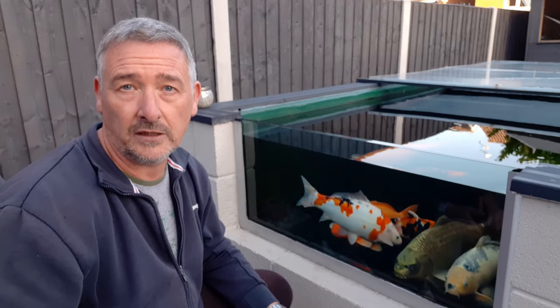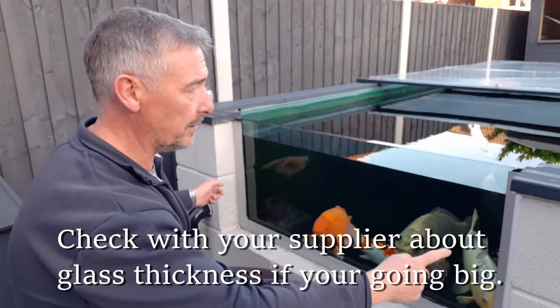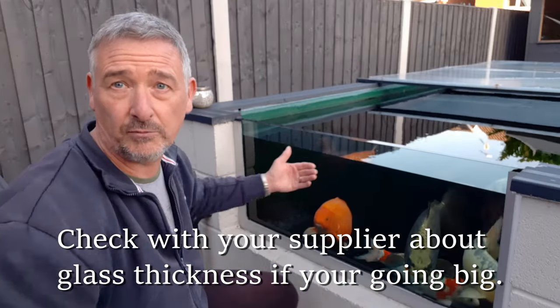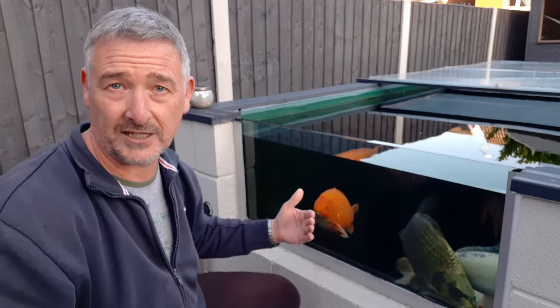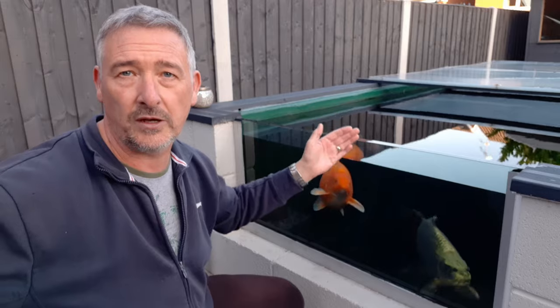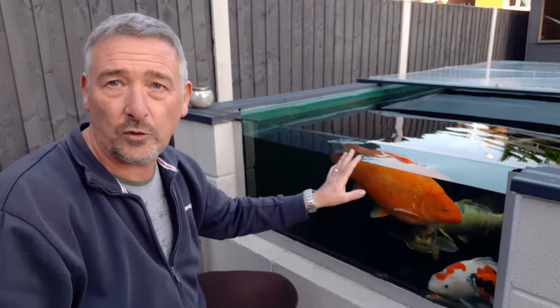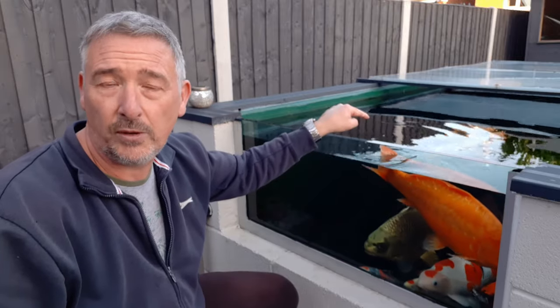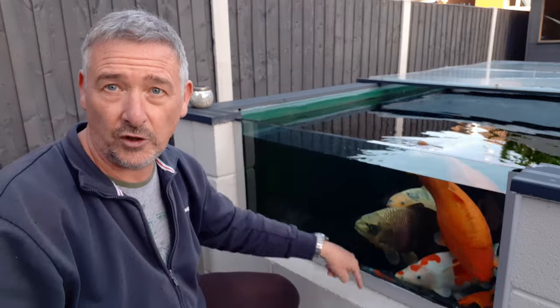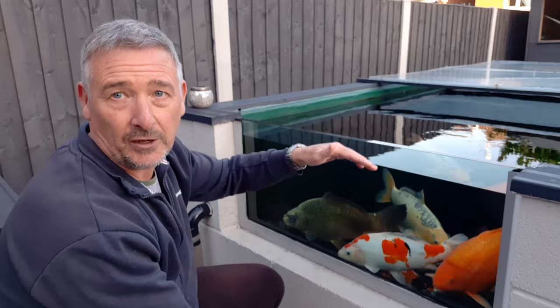The engineering is a little bit different — you've got to start thinking about what kind of frame the glass is going to fit in. The larger your glass, the more volume of water you're going to have pushing against it. I've seen someone online who built a pond with a huge window and it actually bowed because of the pressure. The major pressure is down at the bottom, not at the top, so up here isn't too bad — but again, it depends how deep you go.